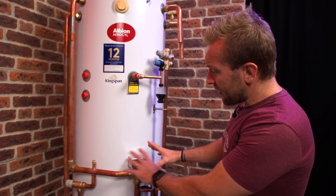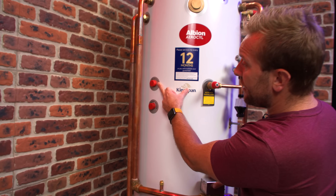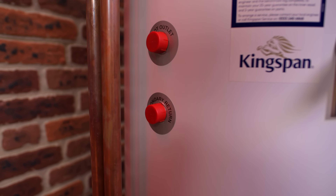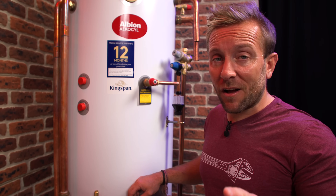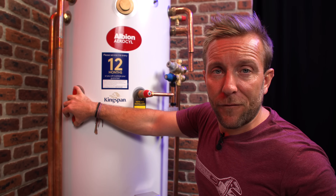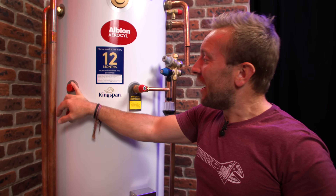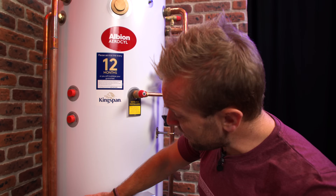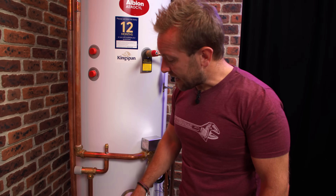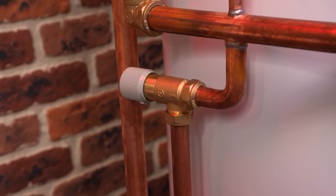Let's have a look at some of the other components on this, because it's a pre-plumbed unit. We've got a hot outlet that goes off out to our hot water taps, and then a secondary return coming back in should you have one — if you're doing a new build or loads of work on your house, get yourself a secondary return, they're very useful. Coming back down here we've just got an air vent, and then we've got an automatic bypass going back down here — we put bypasses on systems all the time, very handy to do.